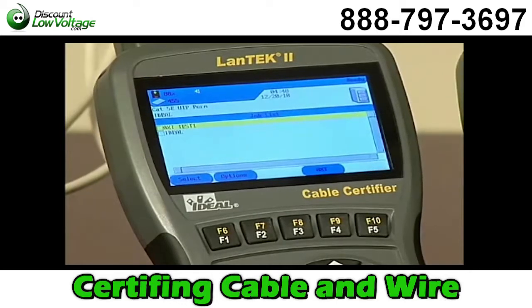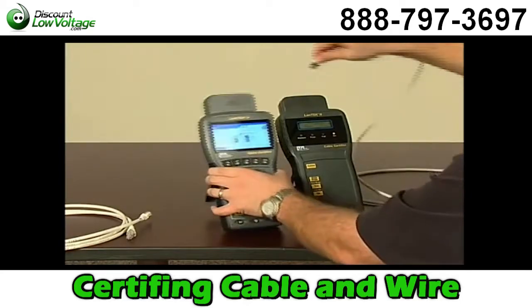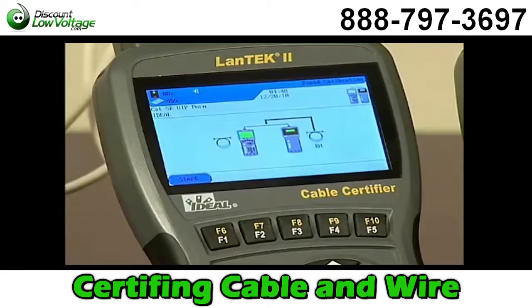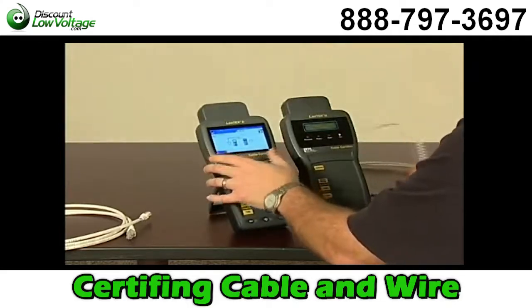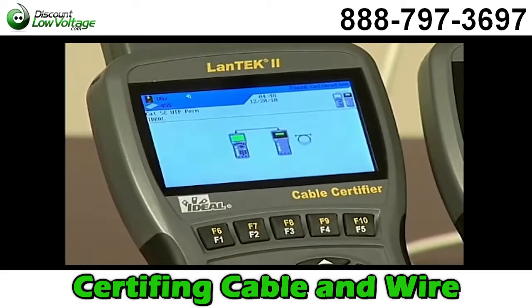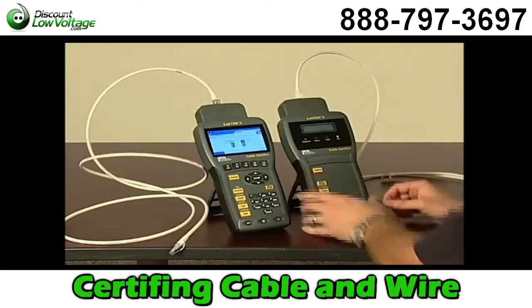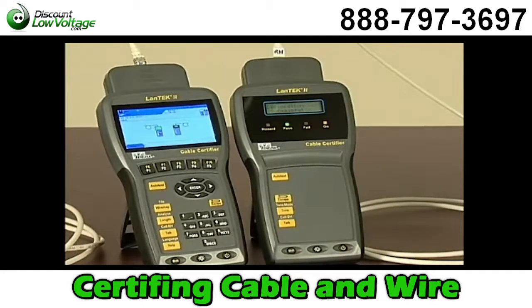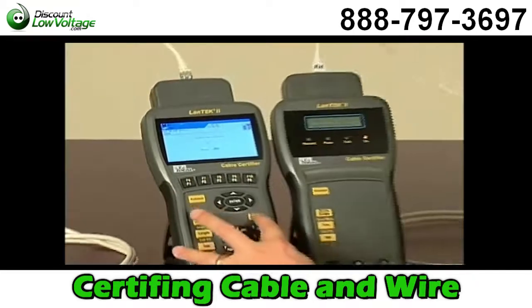Return to the Ready screen, highlight the field calibration icon, and press Enter or F4. Connect the remote handset patch cord between the two units — you can use the provided cords or the brand of patch cords that match the installation. Press F1 to start the calibration process. Then disconnect the remote handset patch cord, connect the display handset patch cord, and press F1 again to calibrate. Finally, disconnect the display handset patch cord from the remote handset, reconnect the remote handset patch cord to the remote handset, then press F1 on the display handset and Auto Test on the remote handset. When both reference patch cords test good, press Escape — the units are now ready to run tests.